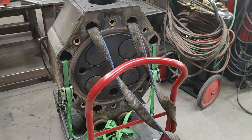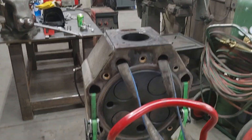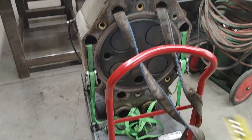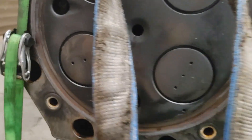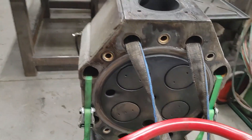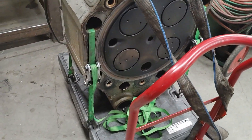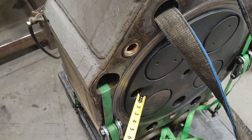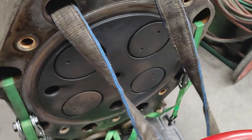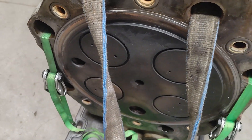So here we have the head. It's stood up on its side, so the exhaust manifold is up and the intake is down. Just under five inches. You've got all these water passages, the oil passages down there at the bottom. This is where the jet cell would sit with the natural gas. The injector would sit in the middle, and that's the air start valve down there.